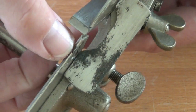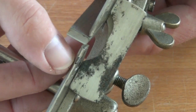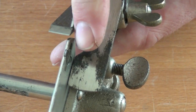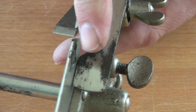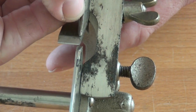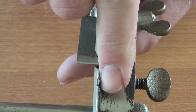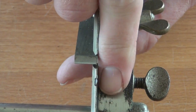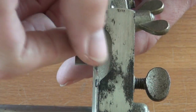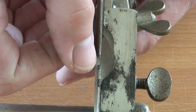The spurs should be well sharpened — sharpened on the bevel side with just a light pass on the flat side to take off any burr. The reason for that is we want them to stay right on the edge of the sole. If we were to grind too much material off the face, we would move the position of the cutting edge within the line of the blade, and then they would not be functioning as they are meant to.